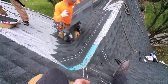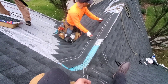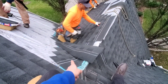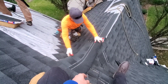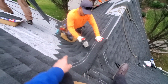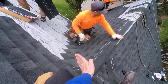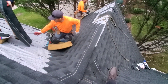He might back this one the other way, overlapping at six inches past, since he's coming up out of the valley about halfway at the shingle. But he's at the top so it doesn't really matter at this point. Down there, those steps are where he's taking the shingle back that way — taking that offset 12 inches in that direction just to save shingles basically.